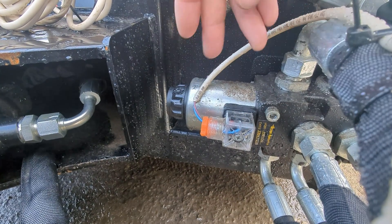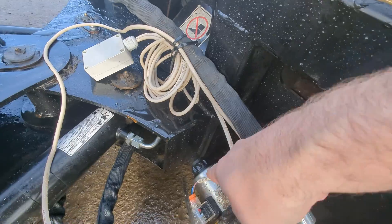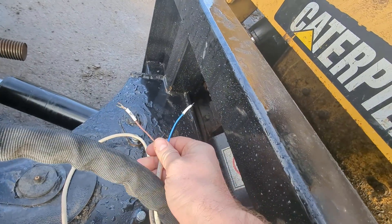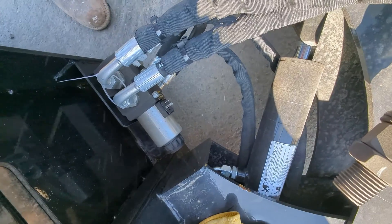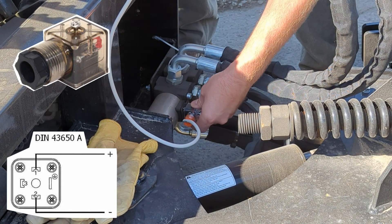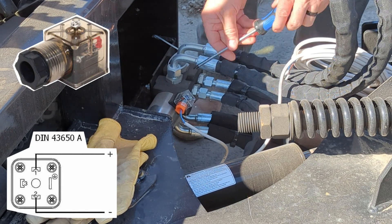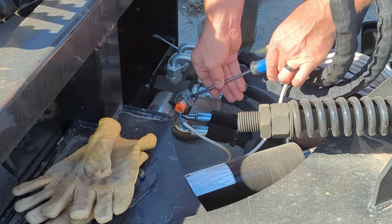Here's where we plug in to the actuator itself. There are going to be four prongs all the way around, but in this one you only use two. This cord splits and runs into the switch — on and off — and to your cable, which is just positive and negative on the battery terminal. Here's what the connector plug looks like beforehand and where it goes. If your plug did not come wired, here's the wiring schematic — it's really simple, just a positive and a negative. We do not use the ground. All we need is a Phillips screwdriver to screw it in and hold it in place. Simple as it gets.